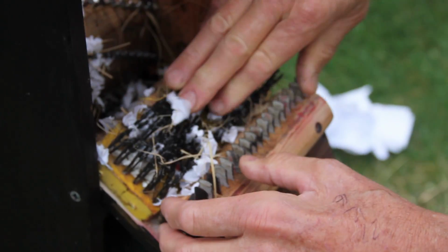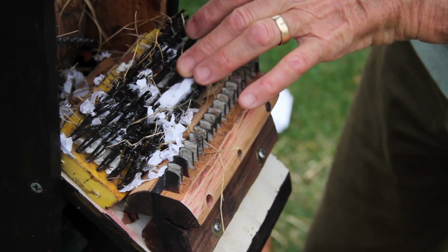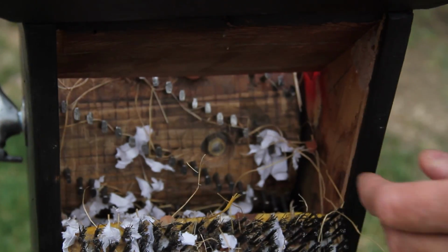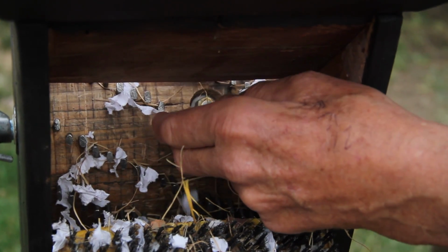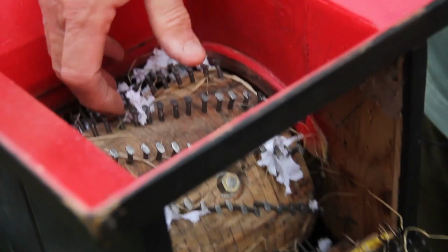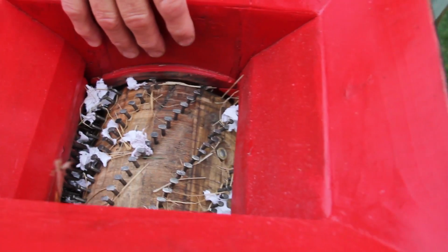This other and final element is nothing more than a common scrub brush, a wire brush that you buy in a hardware store. The spacing between the bristles on the brush aligns with this drum in the center, which is a bunch of 2x6s nailed together and turned. So they're relatively round, they don't have to be perfect. But these are a bunch of nails, common nails, just pounded in. And we used a small disc grinder to create this oval shape on the head so that they can easily pass through the wire brushes on this side. They're all lined up. There are small adjustment screws for that.